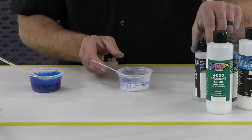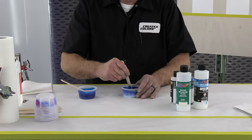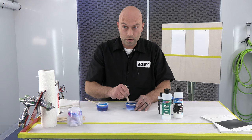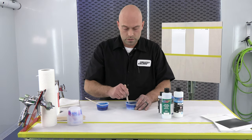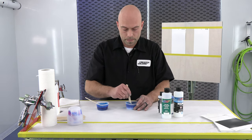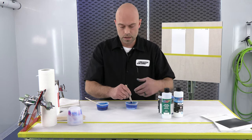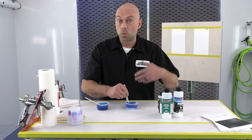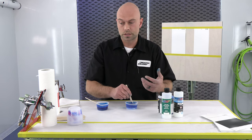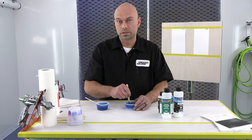But even at ten percent, it still flows pretty good through an airbrush. We'll show you the difference — my hand speed is probably going to be a little bit slower. But it's not terrible; if you have to reduce another five percent, you can go from 10 to 15, or from 15 to 20. With our airbrush paint line, we're not really stuck to a baseline — you have to be at 10 percent. If you have to go to 20 or 15 percent, it's okay depending on the airbrush you're using and what you're spraying. There's really no set standard, though once we move to the spray gun, we're a little more adamant on a 10 percent reduction — we want everything to be consistent.